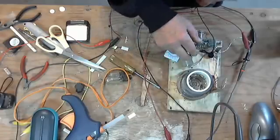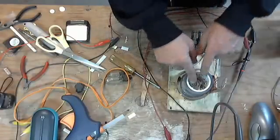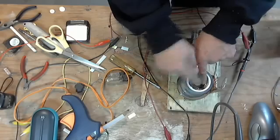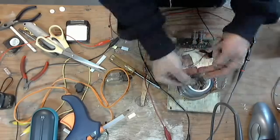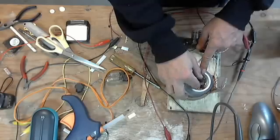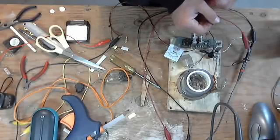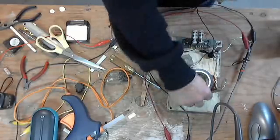What I do know for sure is if I do go north-south, north-south, what will happen is these magnets inside the frame will try to pull inward towards one another and meet at the center. So I'll have to have some sort of block in the middle to prevent them from collapsing into themselves, because they are very, very strong magnets.